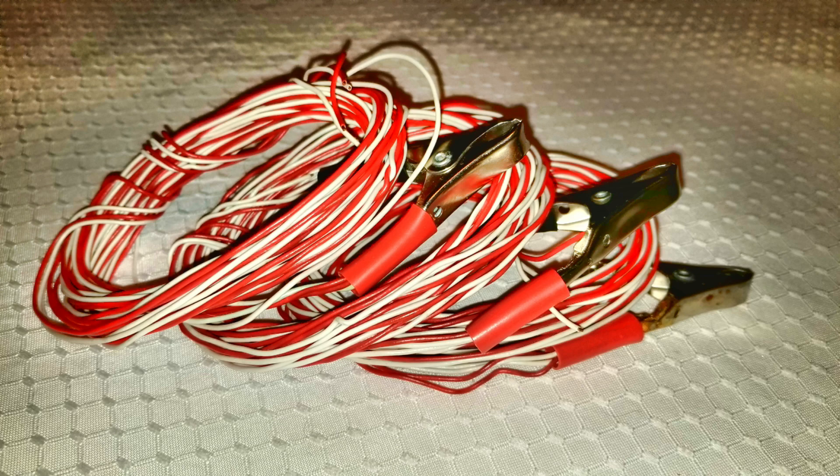This was the set of radials I had made a while back using some cheap three-strand wire — three radials for each alligator clip. I used alligator clips as a slightly different design for these radials, which makes it very quick and easy to attach those to the base and take them off again, as opposed to having to screw them on and off the actual legs with ring terminals. These are not 33 feet — I think these were probably 16 feet, somewhere in that range — and there's three per connection, so you still get good coverage for the different bands. They worked okay, just a little bit more to deal with as far as uncoiling and spreading them out.